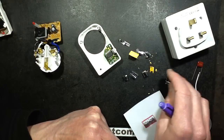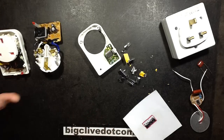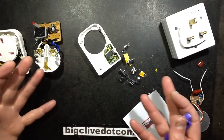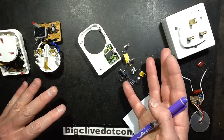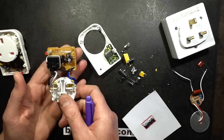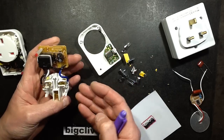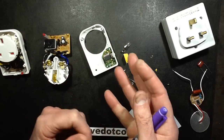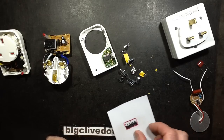So that was really interesting — suddenly lots of things make sense. Dimmers starting to fail. Interference suppression capacitors starting to fail, because you don't see it happening. Unless you actually went and measured those capacitors, you're not going to realise that the interference suppression capability — the ability to pass those spikes and transients — is gradually reducing. And that could cause things like processor crashes because the transients aren't being removed effectively anymore.